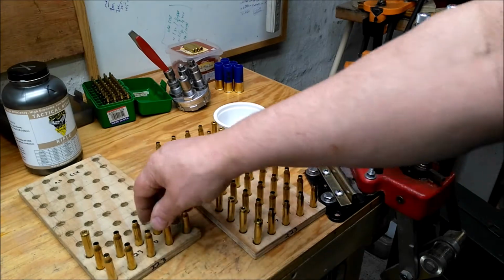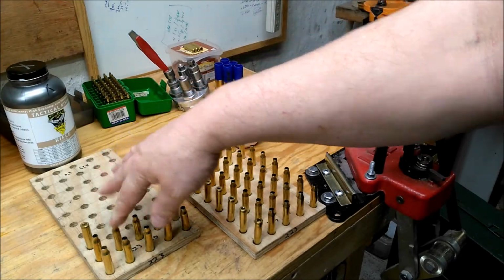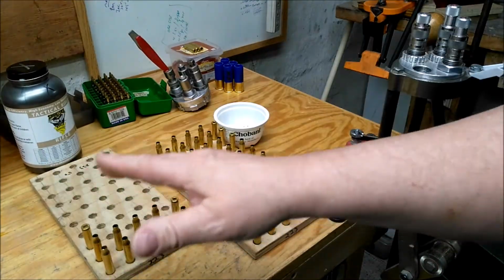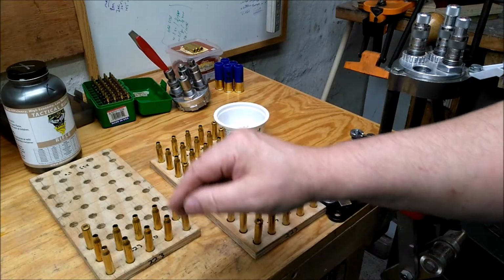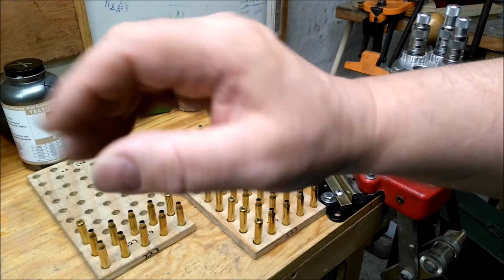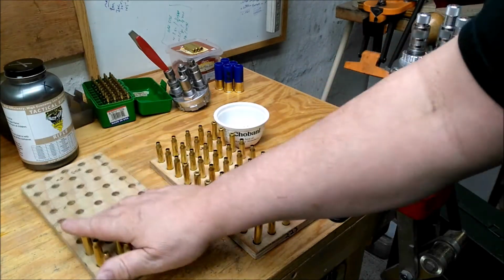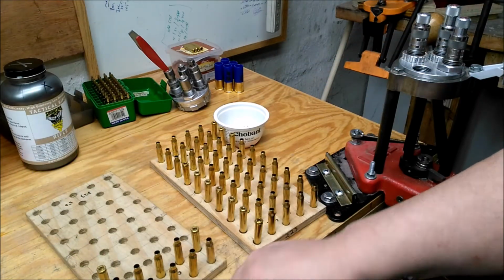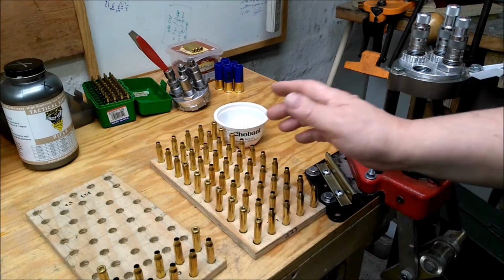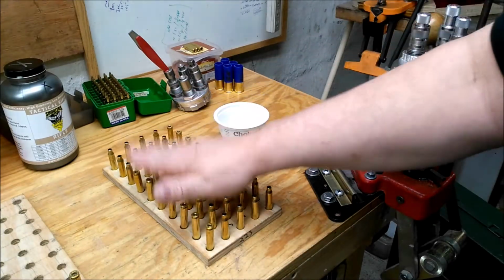Now, since I'm using 1/2 inch plywood here, in the depth I've drilled, set them in, I couldn't go quite to where it bottoms out on the shoulder, which would be ideal. I had to make a bit of a compromise because at that point they would be protruding through the bottom 1/16 of an inch, maybe 1/32, just enough to rub and screw up my bench, maybe mess with brass, who knows, depending on what it caught on. So I went almost through and stopped, but it's enough.